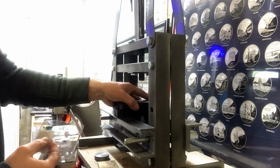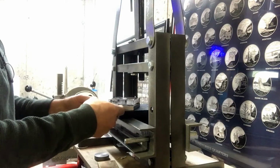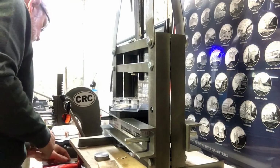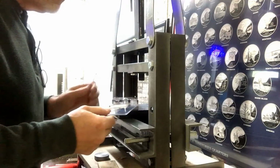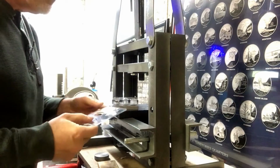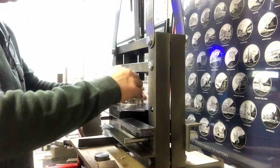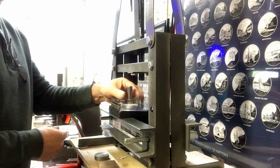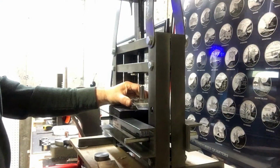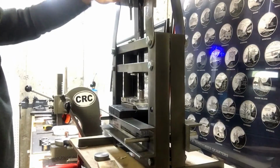I'm going to bring it over to the 6-ton press and punch a 5/8 hole in it. Now, the 6-ton press makes this pretty easy. Just making sure I have the right punch for the right hole. Okay. Now, these punches, the straight edge goes down, the beveled side stays up. And now I just give that a couple of pushes with my press and push it through.